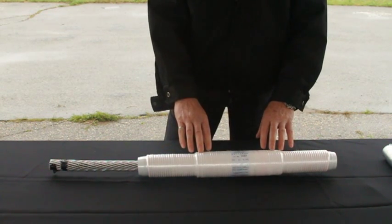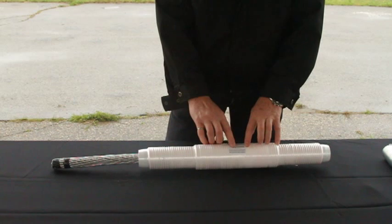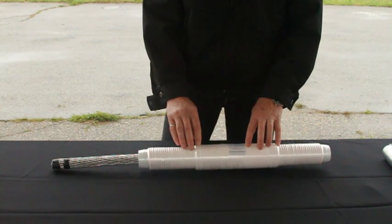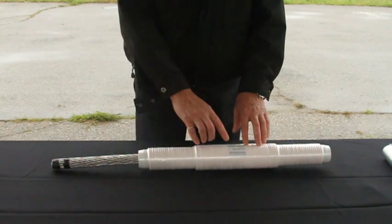To initiate the sleeve, we use a detonator. The detonator is a non-electric type — it has a little cap, and attached to it has a small plastic tube, similar to a fiber optic. The tube is the one that carries the signal from the initiator to the detonator.